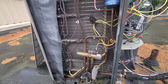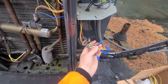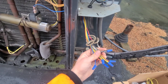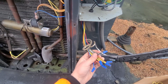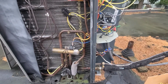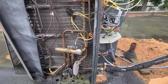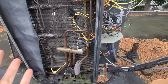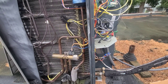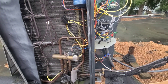On the indoor, you'll have cooling going. This little black wire that's coming off of the outdoor unit is going to send a call for heat down to the indoor unit to kick on the strip heat. When that strip heat is running, you won't notice that the air conditioning is technically going on down there in that coil, because if you have hot refrigerant out here, you're going to have cold refrigerant down there. So when it's in defrost, it's going to kick on your backup heat source — if you have a gas furnace it'd kick on that, or if you have electric heat, which is what we have here, it's going to kick on that to counterbalance so you're not feeling cold air.